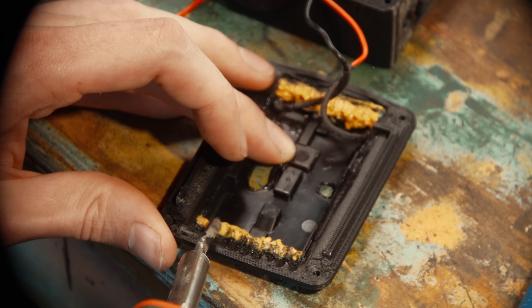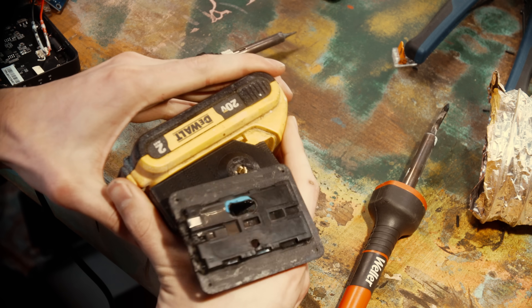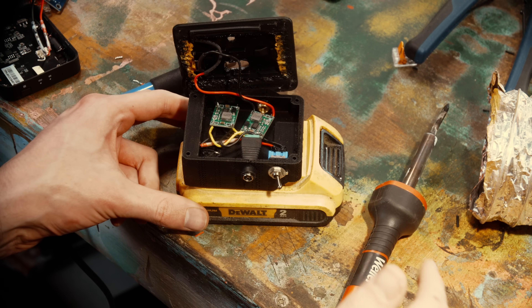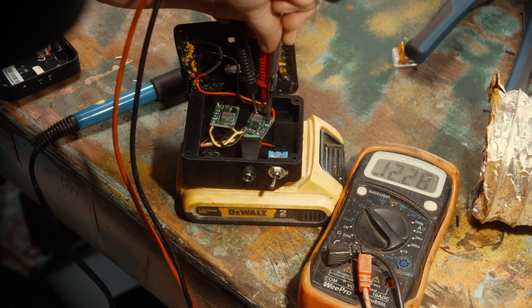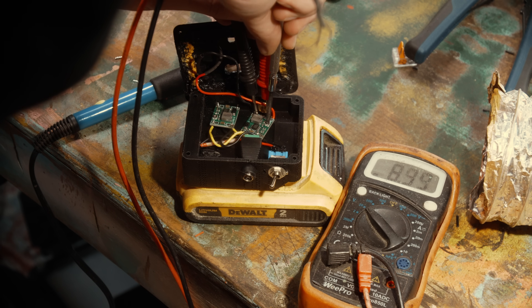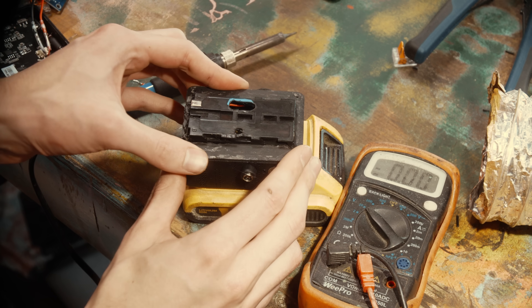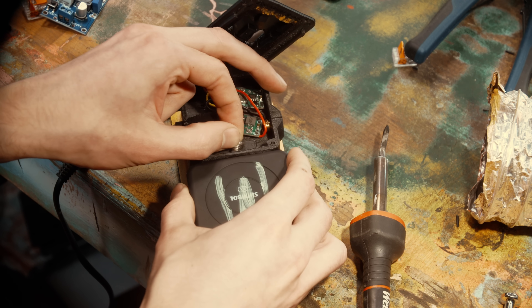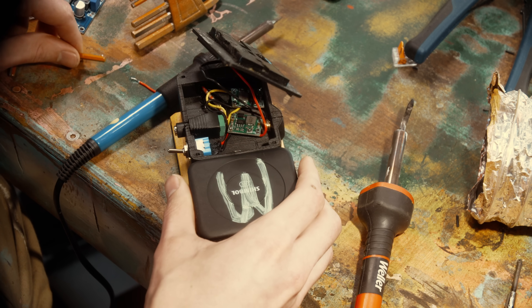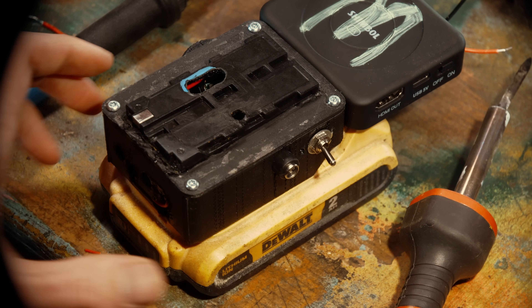Should be a lot more secure than the previous iteration. Let's see how this fits. Perfect. Now I can get a battery plugged in, switch it on. I'll put a little dot on the on-side. Then I turn that little calibration screw till we get to 8 volts for the monitor, and same thing on the other one — down to 3.75-ish volts. Now I want to hard-mount this wireless HDMI to it. I put a screw hole in there where I wanted it. That feels firm. Send a couple spare screws through there — sweet, that feels sturdy. There's the unit.